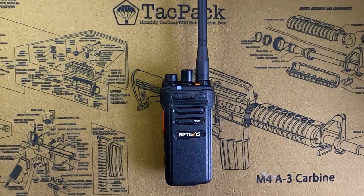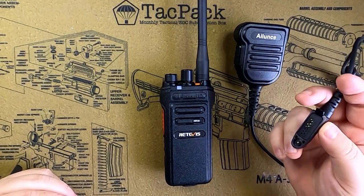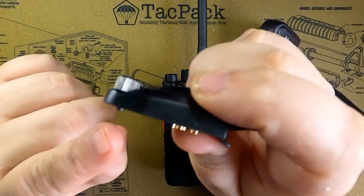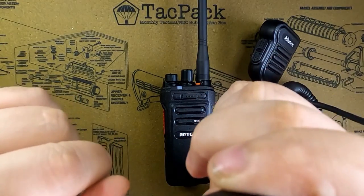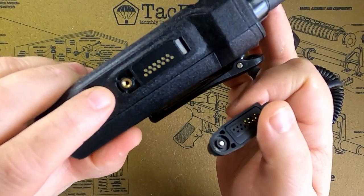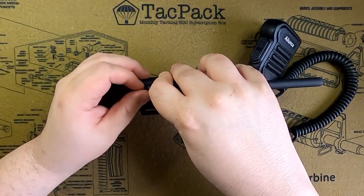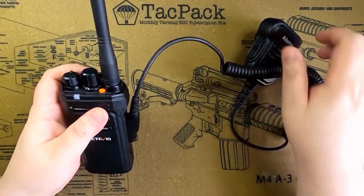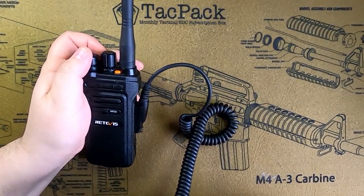You can utilize some of the Ailunce HD1 accessories. Here is an HD1 speaker mic. What I did — if you look closely — there's usually a tab that sticks off at the end. I just cut that tab off slightly with a knife, because the port opening on the NR30 is just slightly narrower. Instead of trimming it all down I just cut it off. Now if I place this on here I can screw it down and it gets a nice firm tight fit, so it does keep that waterproofing ability. Turning the radio off and on, you can hear the audio coming out of the speaker mic now.